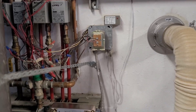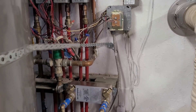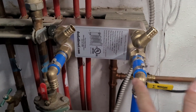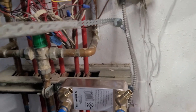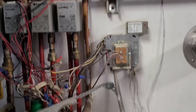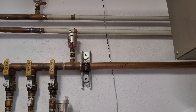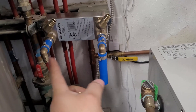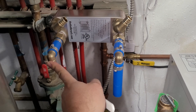I know this is not my mess — this is how it was when I bought the house, and maybe one day I'll have time to clean it up. But the focus of today is this: the intake side and the output side, reversed on the other side. On one of my loops I'll be taking the hot water, coming down to the intake side, out here, and back up to my loop — where it should be a little cooler. The domestic water will be coming in from the cold side and coming back out hopefully a little warmer on the other side.